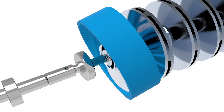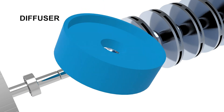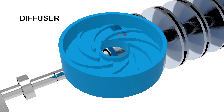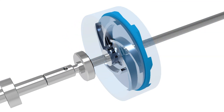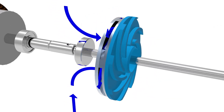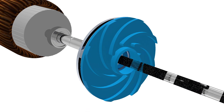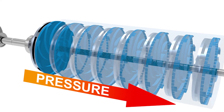The outgoing fluid will have to flow efficiently through the second impeller. For this reason, a diffuser is used to create an axial flow motion — the movement of the fluid in an up-and-down cyclic pattern. The diffuser makes the fluid ready to flow into the next impeller by deflecting its inlet flow. Thanks to a series of impellers and diffusers connected to each other through the shaft, the fluid is able to multiply its pressure at each step.